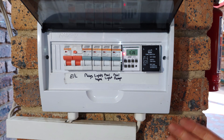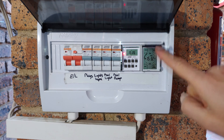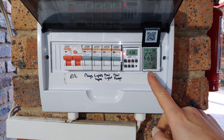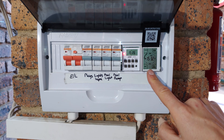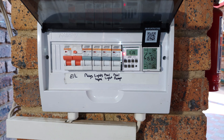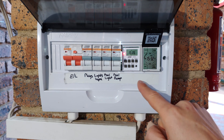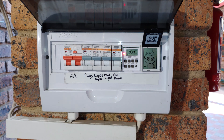This is what it looks like when it's complete — I'm just showing you this so you can see what you're aiming for. There is the MTD timer, and I also have installed a CBI timer, so I'm using two different timers. The CBI timer does work on a DIN rail and the MTD-8 specifically is designed for a DIN rail. You can use this timer for your pool pump, pool lights, and things like that — even a geyser. I'm now going to show you how to do this installation.